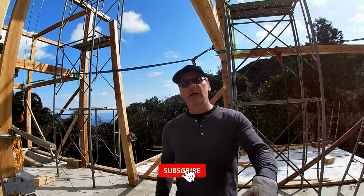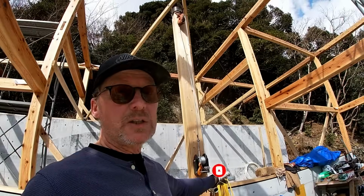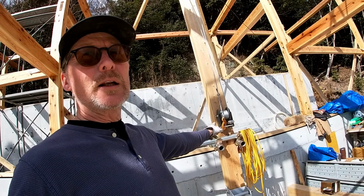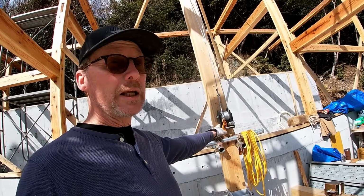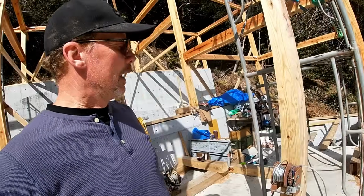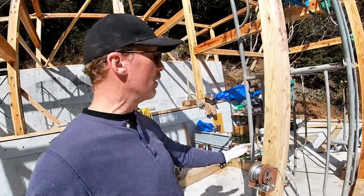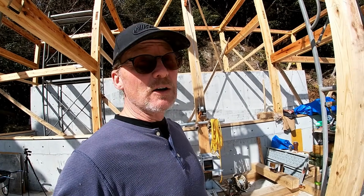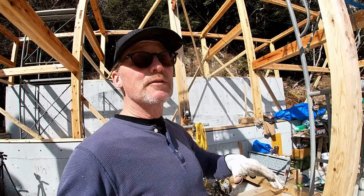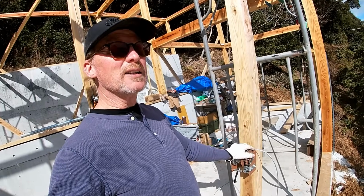So this is my main lifting winch. We had, if you'll recall, the setup, we had 2 winches in place on this stiff-legged derrick crane. We had the winch holding and lifting and setting the boom only, and then on the boom we had the winch lifting the load, the payload. This one, the payload winch, is rated for 1,500 pounds. The boom winch is rated for 2,000. I put them that way on purpose because the boom winch had to lift the boom in addition to the payload, whereas the payload winch only had to lift the payload.